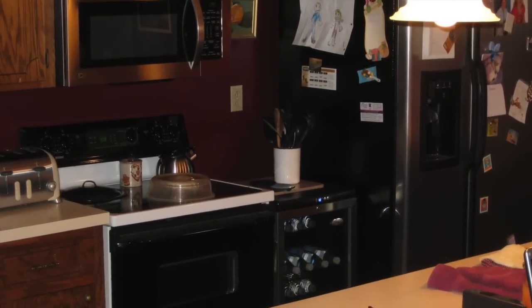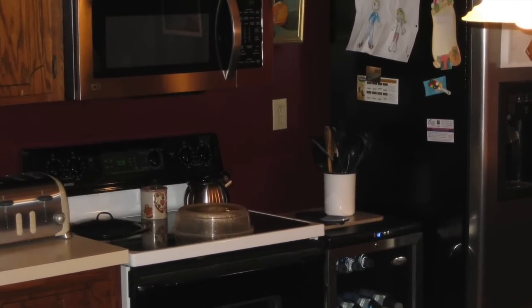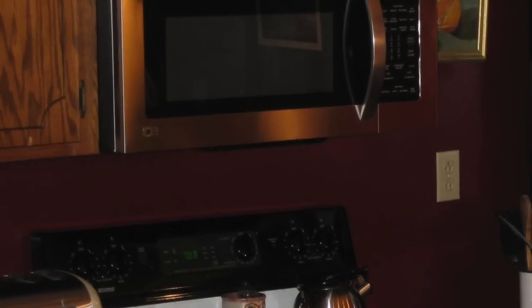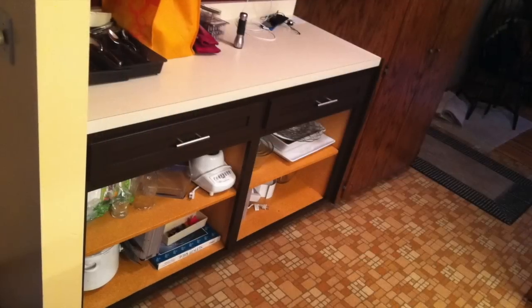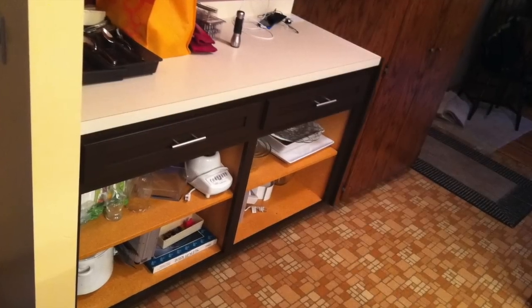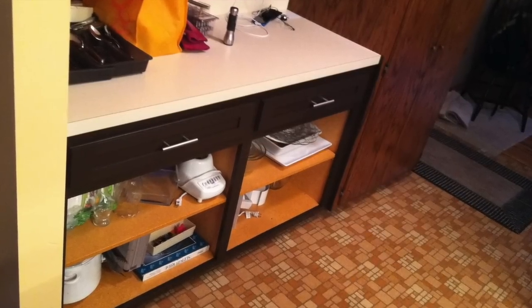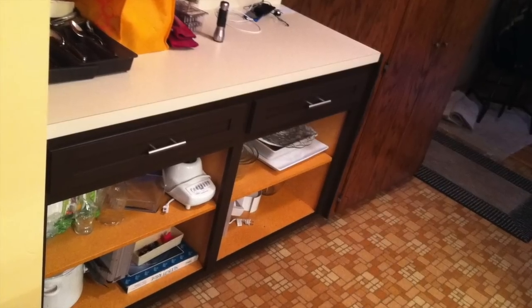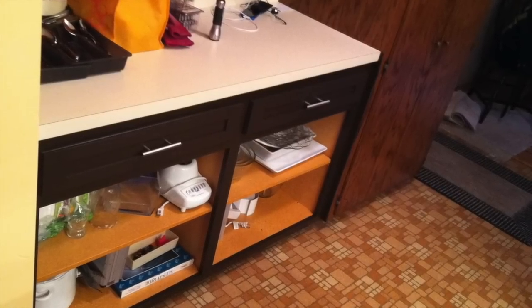The journey begins with a kitchen remodel project. We wanted to stay on a budget but make these old dated cabinets look more modern. They had this groove routed in the side, so I came up with the idea of making them look like raised panels by gluing and tacking strips of wood on the outside and then painting with a really dark paint that looked like a stain. You can see the old ones on the right and the remodeled ones on the left.